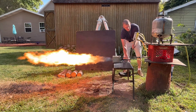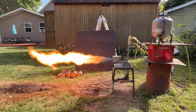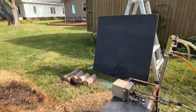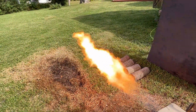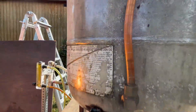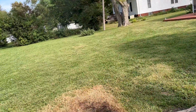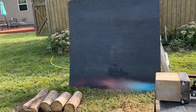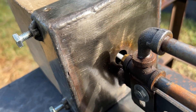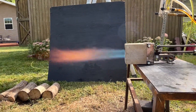I won't give up on the gauge — I was going to populate a list of different power outputs for future reference because I love these video archives; sometimes I go back to them when helping customers pick out a product. This thing runs amazing on diesel. That came out to 75 liters per hour — so we're looking at 750 kilowatts of power, 2.5 million BTUs, which is about 1,000 horsepower if you consider that fuel consumption going into an engine.